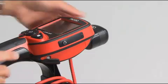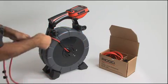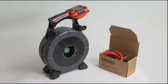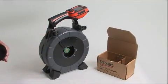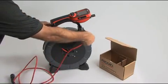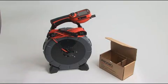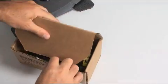To swap modules, disconnect the system cable from the monitor and remove it from the cord wraps. Turn the slip ring module from the locked to the unlocked position and pull it free from the hub. Insert the alternate slip ring module into the hub and rotate it to the locked position. After installing the module, secure the system cable in the cord wraps on the case. To protect the pins inside the module from damage, we strongly recommend storing the unused module in its shipping box when it's not installed in the Microdrain.